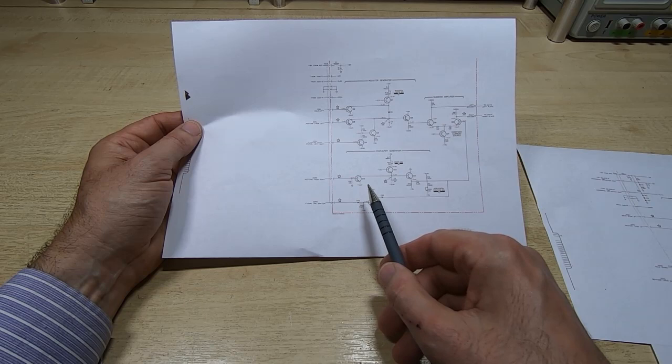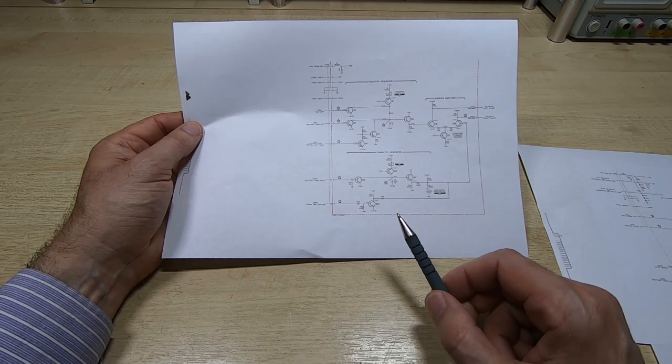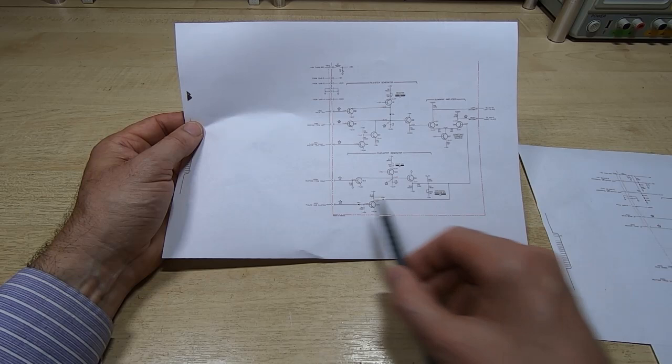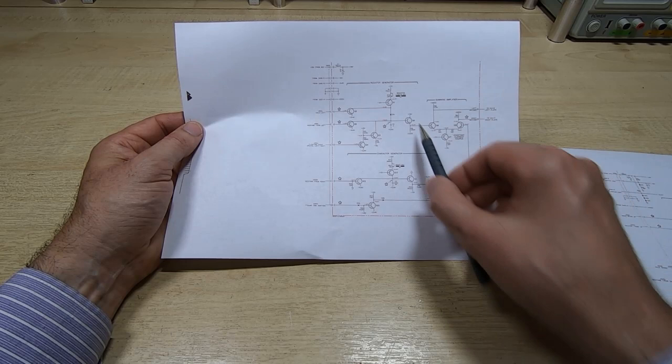So if it's drawing a 1, then it can move by half a segment width in addition to the character offset that it's already selected by moving to the current character. And that's what this bottom transistor does. It just puts an additional small half segment width step, and then again a summing amplifier adds these two together and gives you the required deflection.